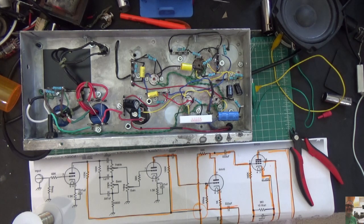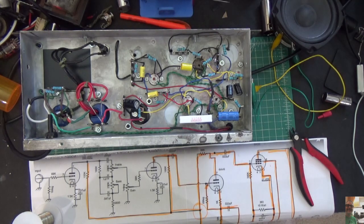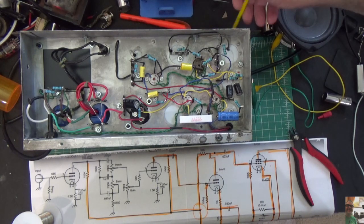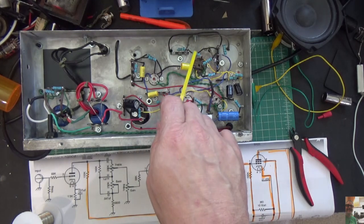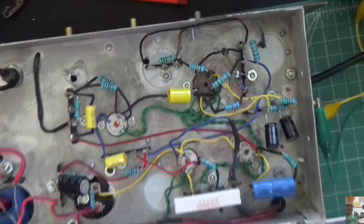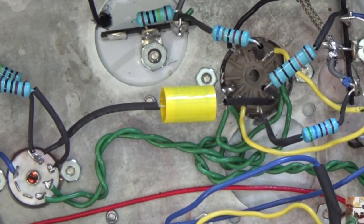Feedback could be a microphonic tube or it could be some kind of wiring problem. So what I've been doing is poking around trying to understand what the issue is. I'm going to show you this first. With the volume up before it starts to squeal, I want you to pay attention right here to this resistor. I'll show you which resistor that is in a moment. So that's the 12AX7, pin 2.